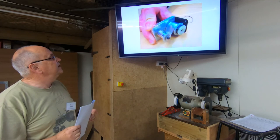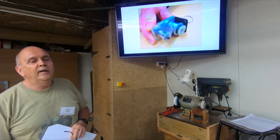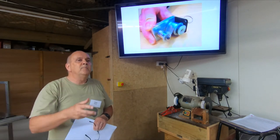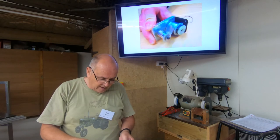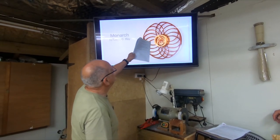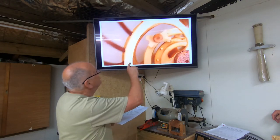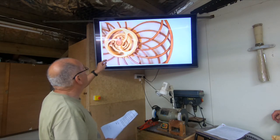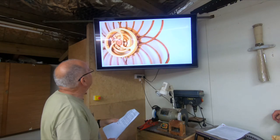You do need an escapement to control these springs and drives — if you let them go they just accelerate, and another time I'll tell you how I know that. The escapement part is where I really came unstuck, because it was much more difficult than I ever envisaged. This next David C. Roy slide shows quite detailed views of the actual escapement. It's deceptively complicated — the wheels are rotating, the little counterweighted detail eventually drops and allows the thing to reverse-rotate and run the other way. I wouldn't be surprised if there's a magnet in there somewhere as well.